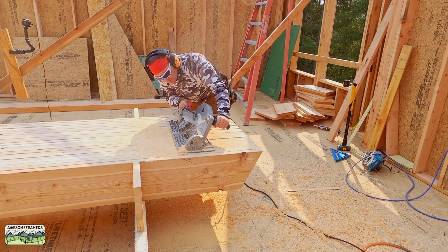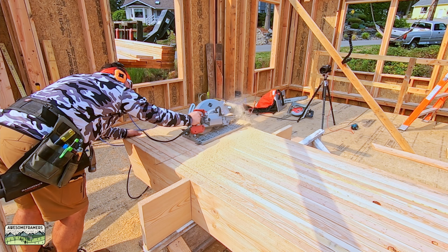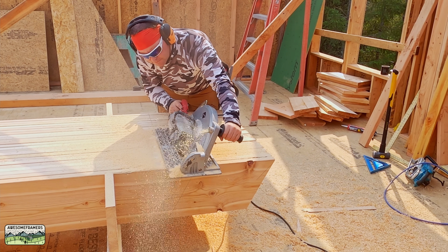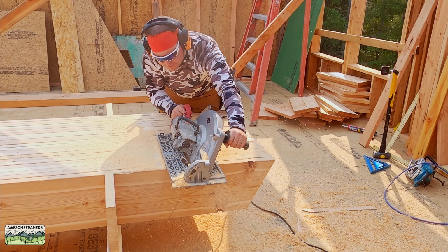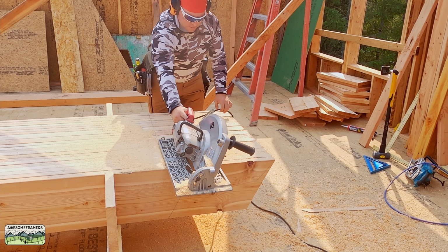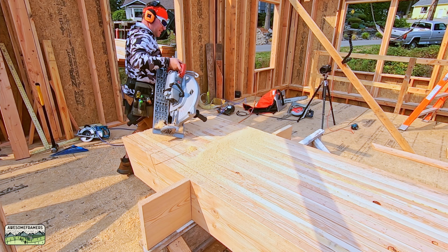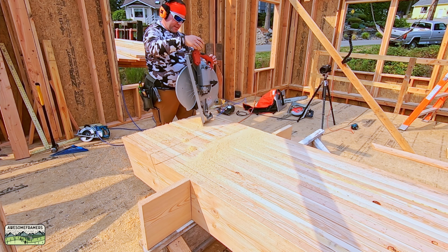You can kind of see there in the bird's mouth that the seat cut didn't quite go all the way, and the plumb cut also doesn't go all the way. So the fact is, I'm going to have to rip my tails in large part because we have the closed soffits already attached to the building. So this is really honestly the slow part. If you're gang cutting and things stay in the racks like this and all your cuts finish, it's like one and done with each cut.